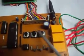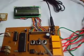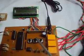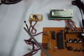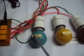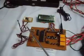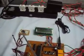This is the microcontroller and we have three switches here. These three switches are used to adjust the upper level and lower level settings for the temperature sensors. We also have three relays here, which are used to turn on a water heater, a bulb, or a fan depending upon the temperatures from the thermal sensors and the humidity sensor.